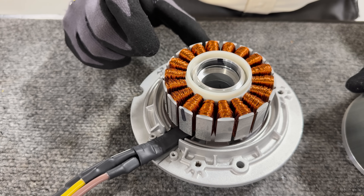It's not a very power-dense motor, though — very reliable — but this motor only gets three quarters of a horsepower of capability. Whereas this brushless DC motor, you can see its size and weight, is actually three times more powerful than that motor. This is a 1600 watt motor and that is a 500 watt motor.